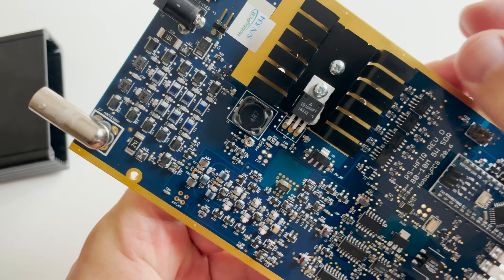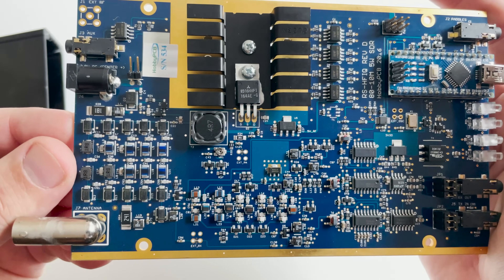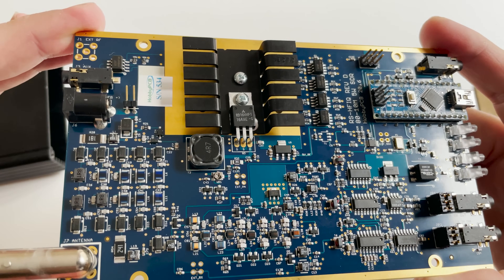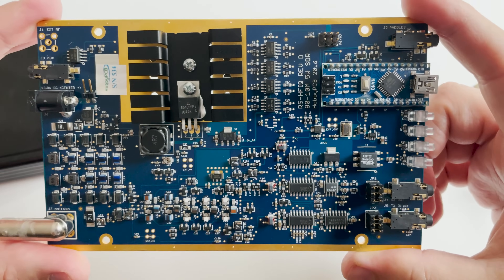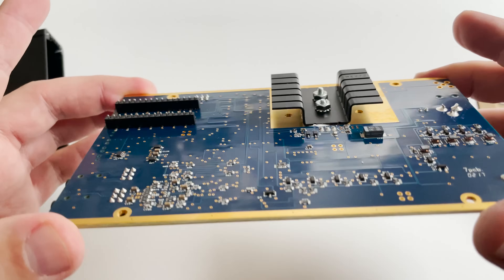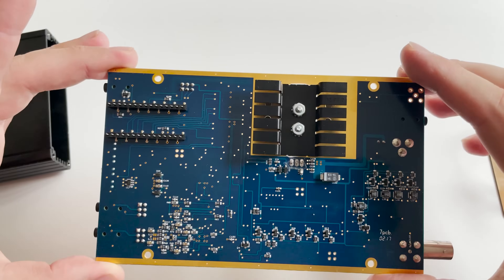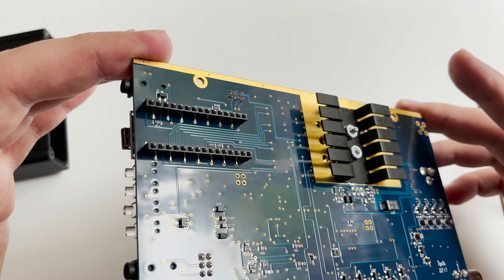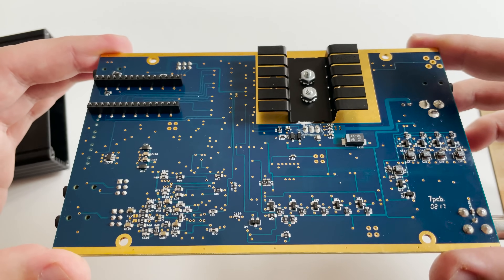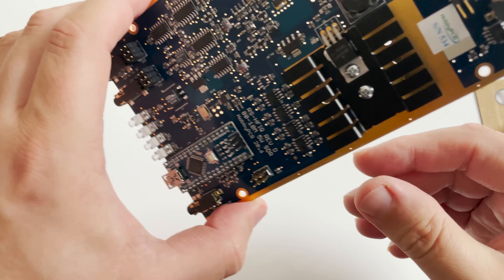On the board of the RS-HFIQ you will see an Arduino Nano, which is used to interface with your computer. OmniRig talks to it to control things like frequency and power levels. A common question is about noise generated from the Arduino — there is none. The developers have carefully placed optocouplers in specific locations to isolate various sections of the radio, eliminating computer noise and ground loops. Furthermore, the RF signals are magnetically coupled using signal transformers.